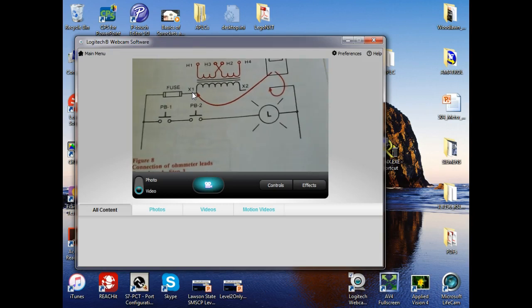So when you're building your circuit, what do you need to do? You need to tag out, right? You understand? I lock out, you tag out. But once your circuit's built, then the tag comes off. Because the circuit is operational. That would be like me coming into a plant and everything's tagged out because we turned it off the day before. So just because it's turned off don't mean you got to do what? Tag it. Everybody understand that?